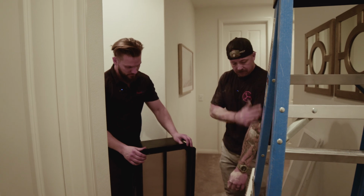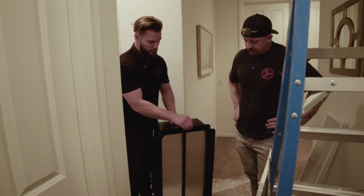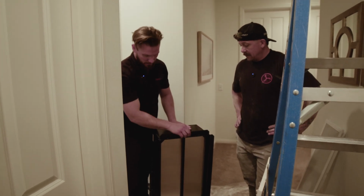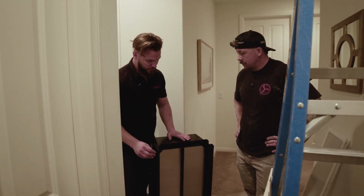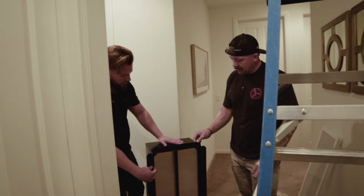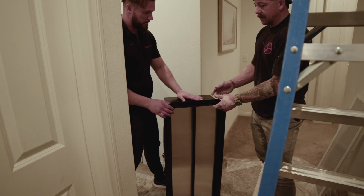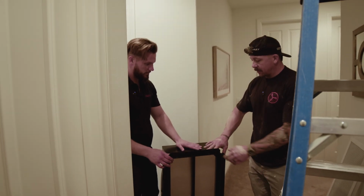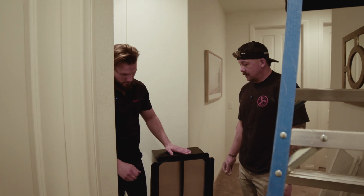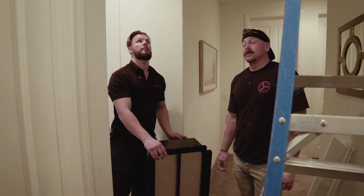Okay, so Michael, previously you talked about the damper box resting on the sheetrock with what you called these edges, the plaster grounds? Plaster grounds. And if we go against a joist, you can remove them. I see these little divots here. Yep, they're just crimped through each panel on either side, and all it takes is prying at the crimp with the flathead, and these will just pop right off. And in this application, we're going to keep all of them on. Exactly. We're using all four.